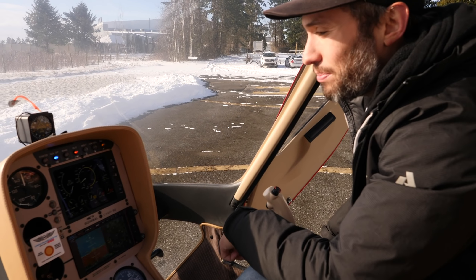This has a three-bladed fully articulated rotor head. The really cool part up here is we've got elastomeric bearings that do all three things that a three-bladed rotor system does — it can lead and lag, it can flap up and down, and it can feather, all through this one bearing right here. And that bearing doesn't take any grease at all. This head actually has no grease on it whatsoever.